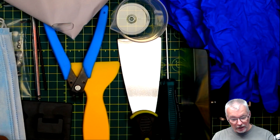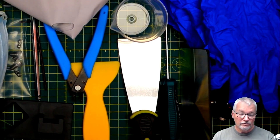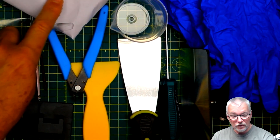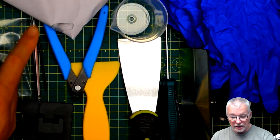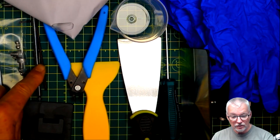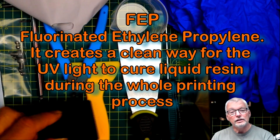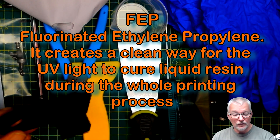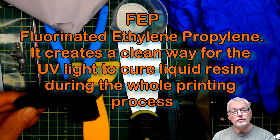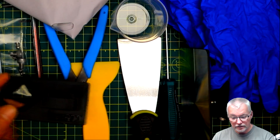So these are all the parts. We've got a couple of face masks — your standard nurse-type masks. Spare machine screws. Filters for the resin if you've got to pour it back into the container. Nippers for taking away support material. A couple of allen wrenches for adjusting the build plate and if you need to replace the FEP. And a little support for the build plate — so when you take it off after printing, you put this on the carrier and it allows you to drip dry the model and the tray, holding it at an angle so it can drip back into the resin reservoir on the machine.